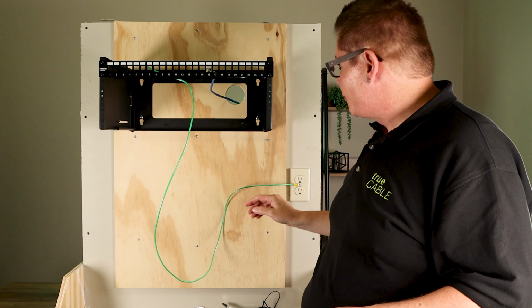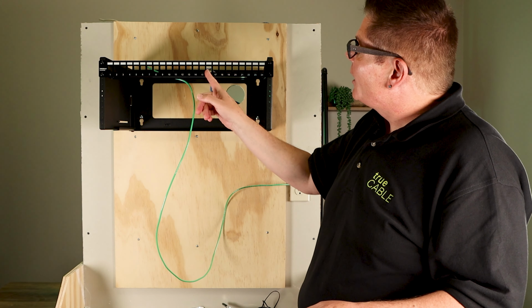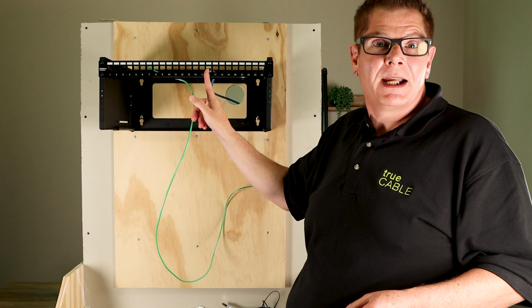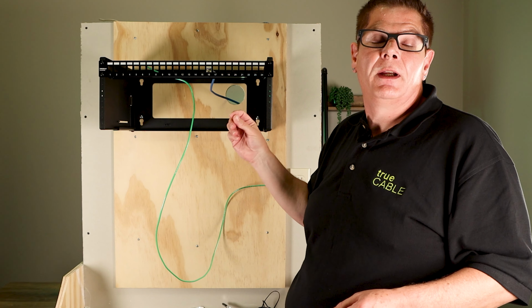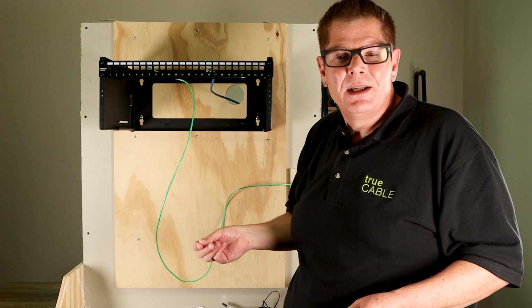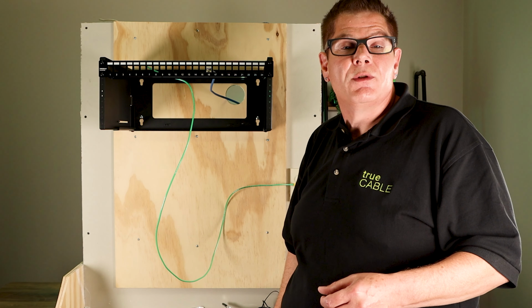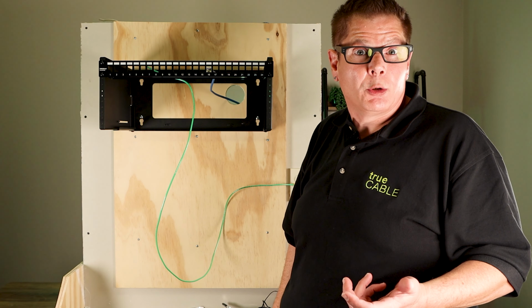Your cable shield is able to drain off at the outlet here, so you can actually use unshielded patch cords. That will help protect your network switch in the case of a more severe ESD hit, because it isolates your switch a little bit. That is a method I use sometimes, especially when I'm dealing with outdoor cable.